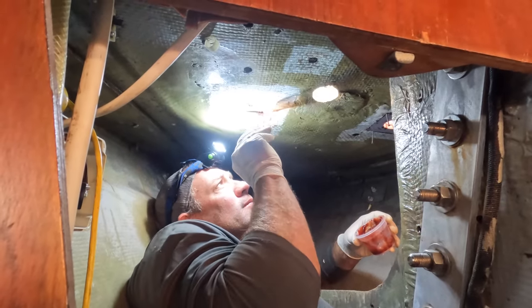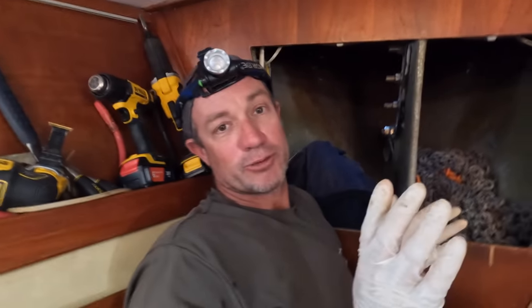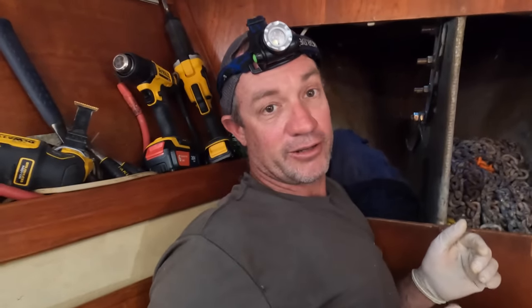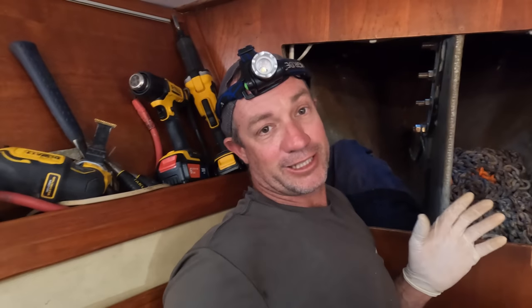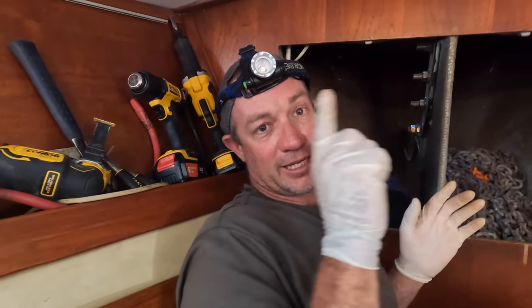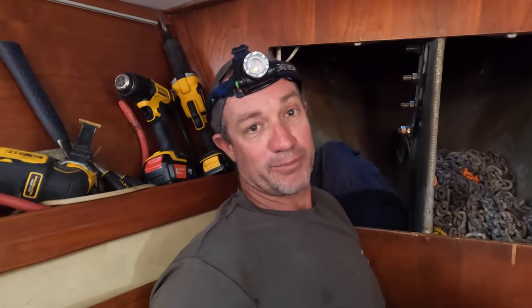Yeah, I'm going to come back in, I'll tape all around that, and then once that, well, not even cures, once it sort of just tacks off, I'll go to the top of the boat and I'll pour down through where the chain holes are, where it comes out. Like I said, I'm going to overfill it all, and then once that dries, I'm going to get the die grinder in there and grind out, and we should have two beautiful solid glass exit and entry points for the chain. And I'm going to put a backing plate on there also.